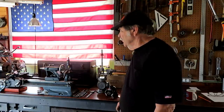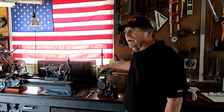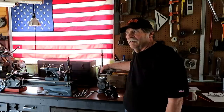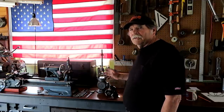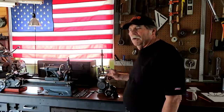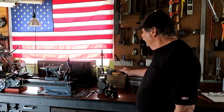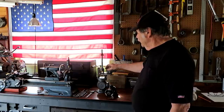On this video, I'm picking up where I left off last year with this Pickering Governor. I've been messing around with this thing for 2 years now and haven't got it done. I really got to get it done now because I'm going pretty good on the Liley engine up in the New York shop, and I'm going to need it for that. So you can pick this up where it left off on video number 63, where we re-poured the main bearing here, made a new shaft, made a shaft here that's tapered, and a few other things.